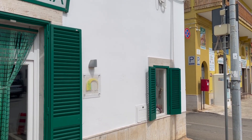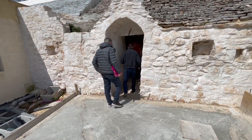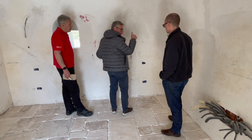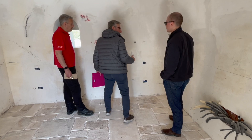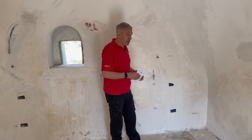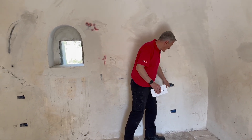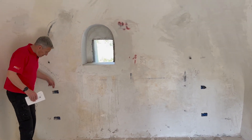After an agreeable lunch, we met up with the project architect and the electrician responsible for the project. I asked: when you take a conduit up a wall, does it always have to go straight? In the UK we can only go straight or horizontal — we can't put anything on the diagonal. I've just learned from our Italian electrician friend that it's pretty similar to the UK with respect to safe zones and where you can and can't run conduit up a wall. We have a safe zone that comes up the wall to the boxes, and you can also wire horizontally between the boxes.